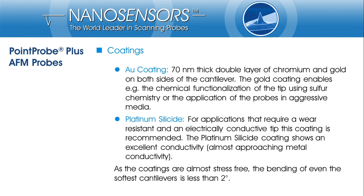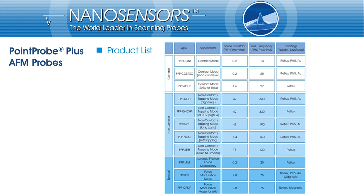All coatings are almost free of mechanical stress and the cantilever bending is guaranteed to be less than 2 degrees, which makes the probe suitable for all commercially available AFMs. Finally, I want to draw your attention to this list of products showing the different cantilever types available as well as their mechanical properties. A huge range of force constants from 0.2 to 50 N/m and resonant frequencies of up to 330 kHz is available, covering the needs of all common application modes such as contact mode, lateral force mode, force modulation, non-contact or tapping mode. Much more applications are accessible by special tip versions and special coatings. Even mechanical properties exceeding this range are possible and eventually already available upon request.